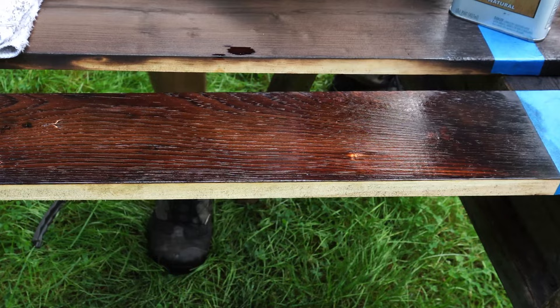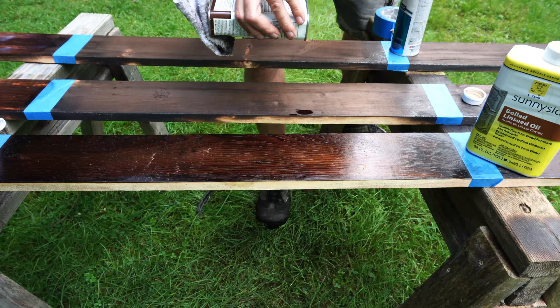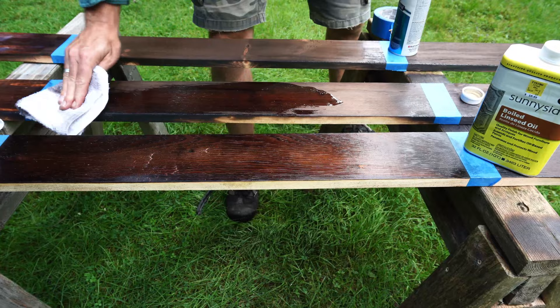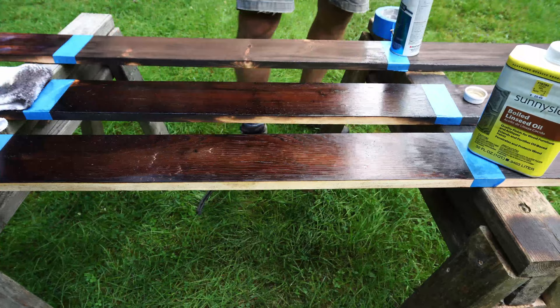Initially it has a bit of a gloss, but that gloss becomes more matte as the oil soaks in. And if you apply the oil really heavily and find that it's not soaking in completely, you can always wipe it down with a cloth after 10–15 minutes or so. Danish oil — what's so Danish about it anyway? You can pour a little add-on here. Let's be liberal with this stuff. Let's see what happens with this polyurethane.